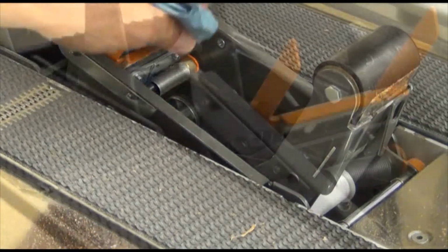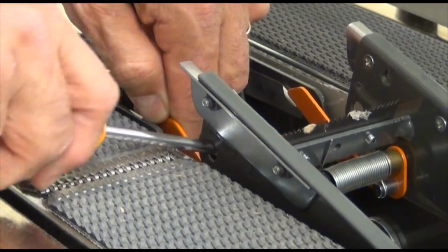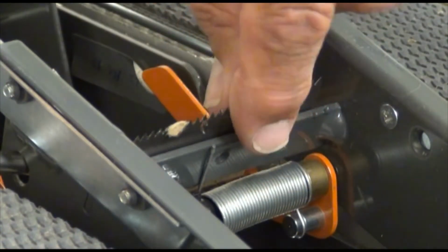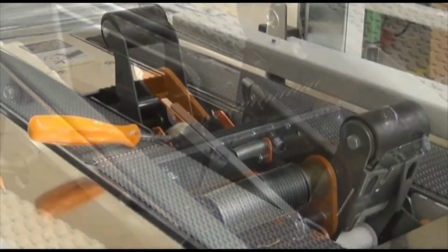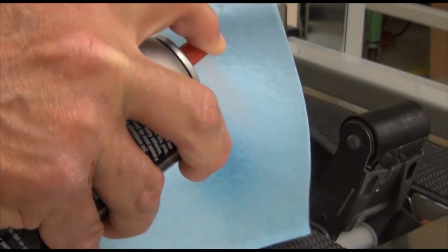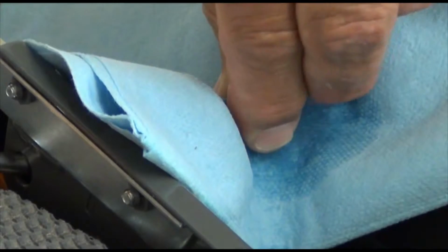Again, be careful when cleaning around the cutoff blades. Secure the blade guard back so you can freely work on the blade. First, carefully remove the pieces of adhesive from the blade. The blade can then be wiped carefully with a cloth dampened with 3M citrus-based industrial cleaner. Wipe away, not toward, the blade edge.